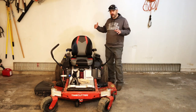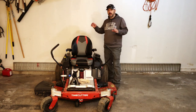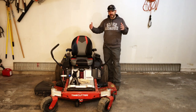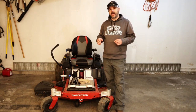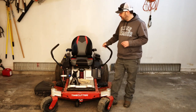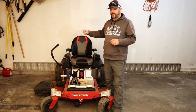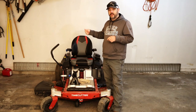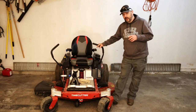To back up the motor, you'll want to either chock your rear wheels or have it up against a wall so it will not roll backwards. Now, one thing different about the Toro Time Cutter — it actually has an electronic brake. Not only is this handle connected to a brake, but once the motor is in the off position it makes those brakes close, and when you turn it to the run position it opens those brakes and allows you to release them with this handle.